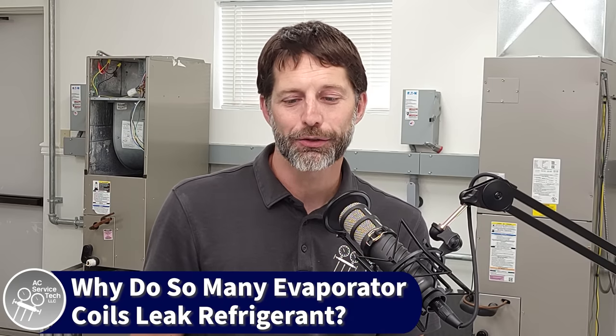A technician named Pete asks: why do I keep finding so many evaporator coils leaking refrigerant? The two most common reasons: one has to do with pulling a proper vacuum. If we don't pull a proper vacuum, moisture stays in the lines, reacts with POE oil, and literally turns to acid. That acid starts eating away the copper inside the system, and then that copper ends up in the compressor — what we call copper plating — shortening compressor life. Some leaks are internal. The other big possibility is external, called ant nest corrosion, related to the chemicals in homes nowadays — building supplies, components, plastics, all off-gassing. These chemicals go across the evaporator coil, and you have copper, aluminum, galvanizing on the plates, and moisture all reacting against each other, speeding up that chemical process.